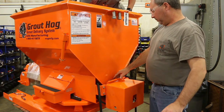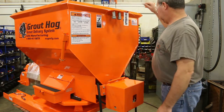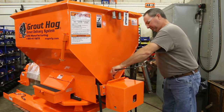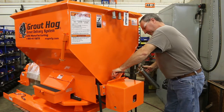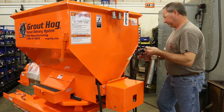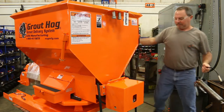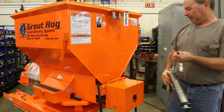When we grease it, we're going to pump grease in until we see some grease come on the inside of the hopper. And we're good to go — put your lines back on and you're ready to go.